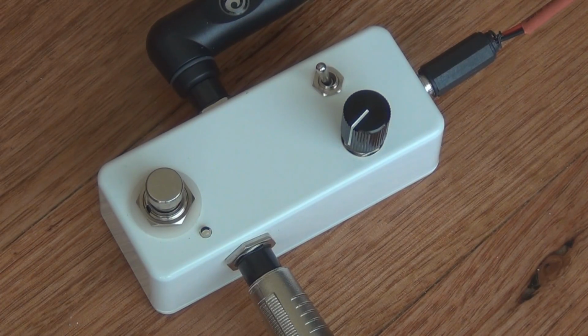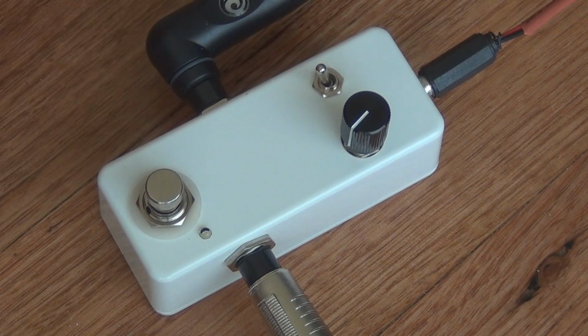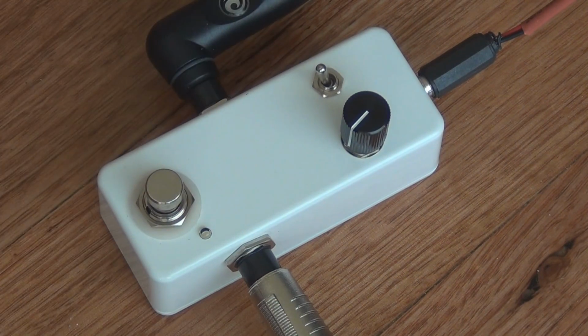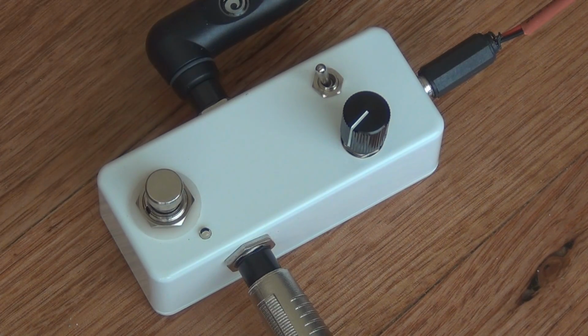So I just showed you on the end there the difference between the volume, because, like I said, I compensated by turning the amplifier down, just so you could get an idea for how much boost you've got. As you noticed, when I turned it off when the boost was on full, the clean signal's quite low compared to the boosted signal. So it's not an unheard of amount of boost, but there's a substantial boost there. Should be enough to push another pedal.